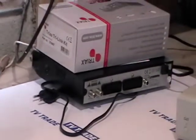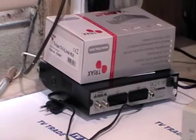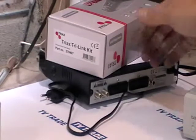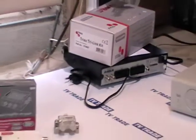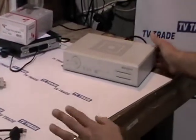These link amplifiers only come in when you want to run to more than one room. Alternatively, we have satellite receivers with no RF output. If you wanted to run one to an additional room, you'd use it in conjunction with a unit called a tri-link, which gives an RF output and also a 9-volt signal, and it can be used in conjunction with link amplifiers as well.